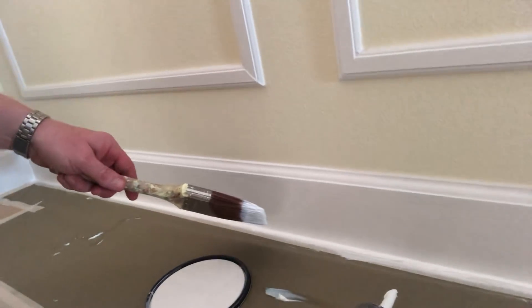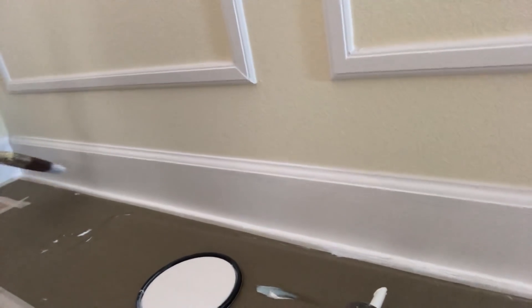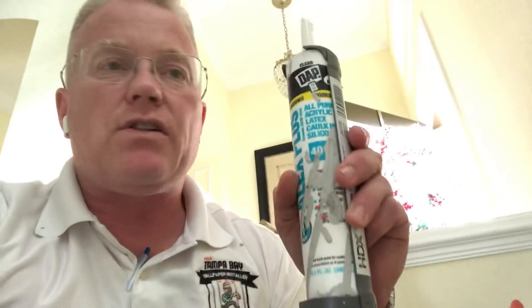Let's recap. First, you're going to use something to block the paint from the floor — whether you choose tape alone or masking paper and tape, you want to make sure you block the point at which the masking touches the woodwork. Tip number two: use clear caulking to block all of those areas. Tip number three: when you finish painting the woodwork, pull the masking up right away, because something called bridging will take place whereby the paper sticks to the caulking and paint and tears it right off the woodwork — even if you've scuffed and prepared the surface sufficiently. Thanks for watching Spencer Colgan's Wallpaper — give me a like and subscribe to my channel.